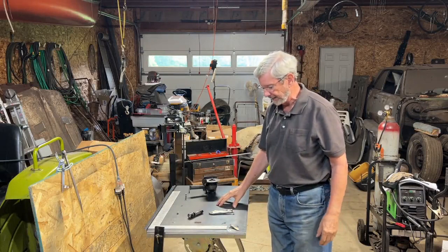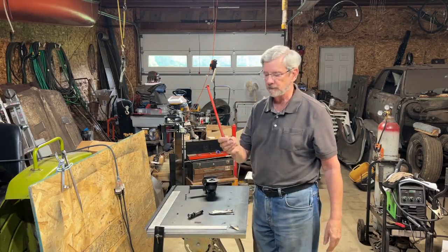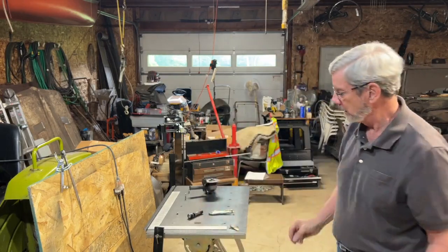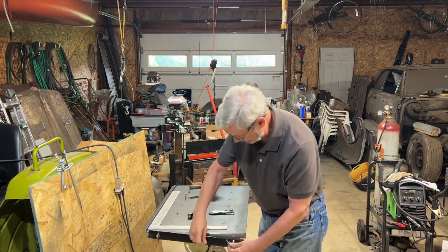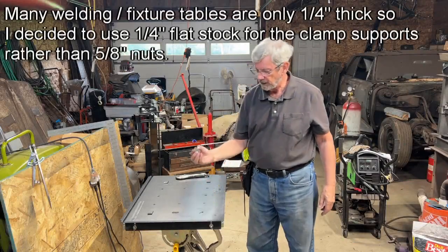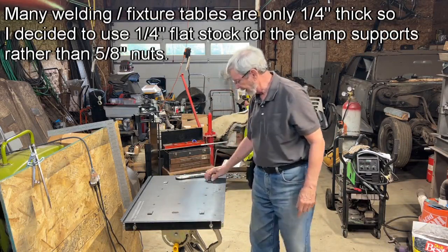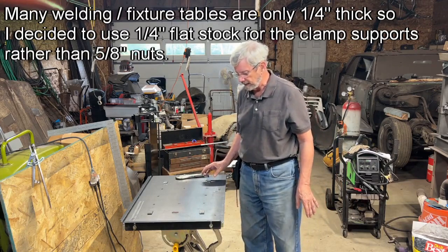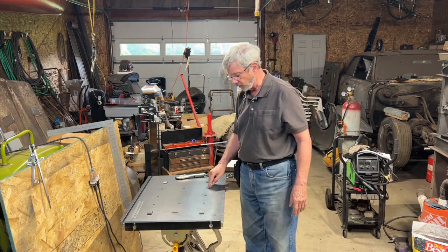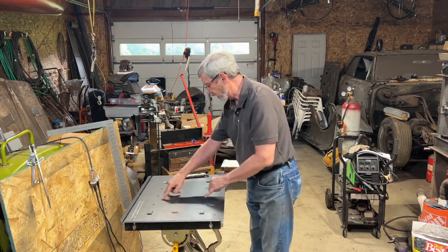After drilling, I decided to square up one side — it was about 40 thousandths off at the end. I took a piece of 20-gauge steel and made a crude shim washer to fit under there; now we're maybe a couple thousandths out, which is close enough for this purpose. I cut four corner pieces from flat stock to weld on the bottom side for the outer four holes. Then I realized I don't have enough flat stock for all the holes.